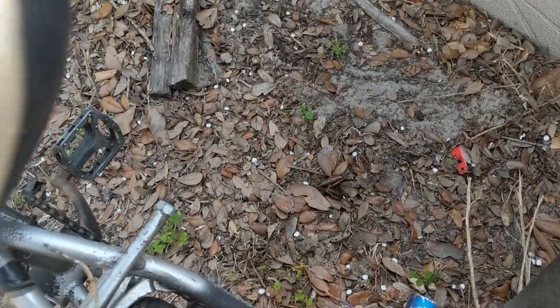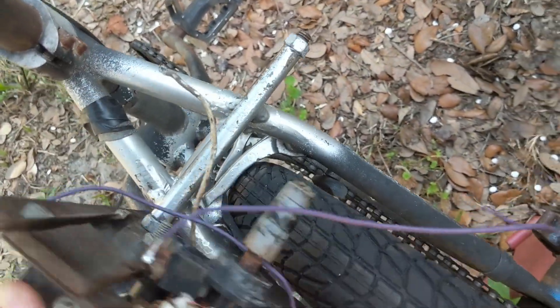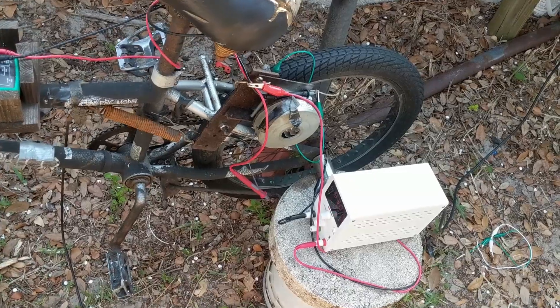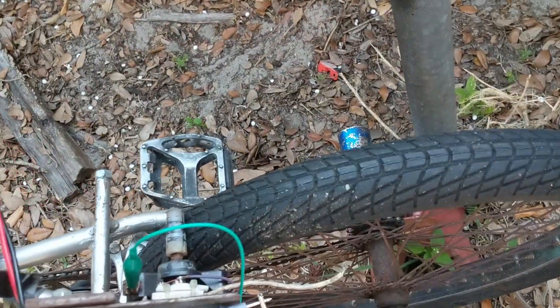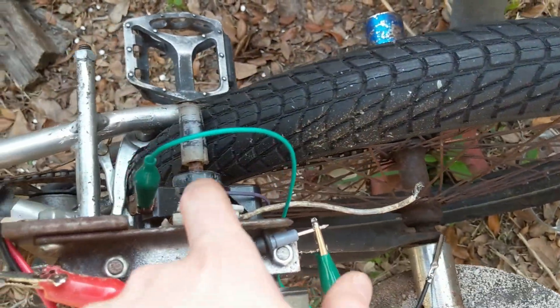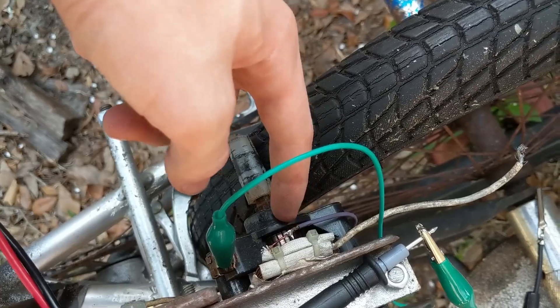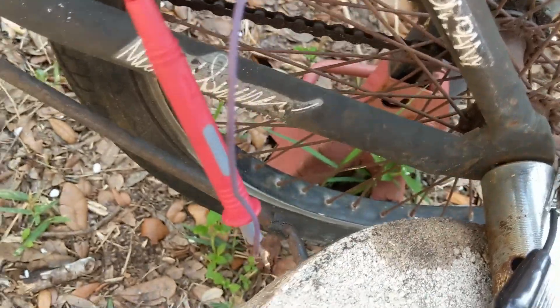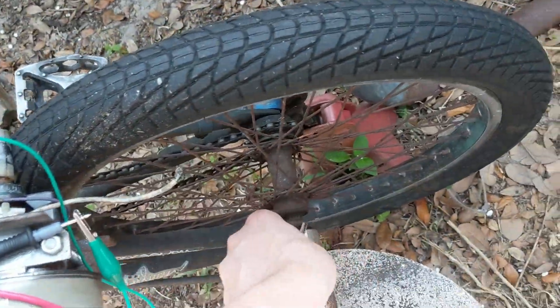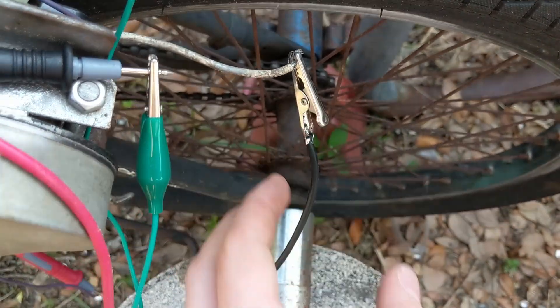I made this as a bushing here to put some spring tension on it. The spring is here but it doesn't have much leverage, so it's nice and easy to roll. I might need to increase the force when I put load on it. We're giving power to one end of this field winding and one end of the bottom field winding, and getting power from the armature. This connects to the voltmeter and the other voltmeter lead is connected to the other end of the armature — see it's sparking a little.